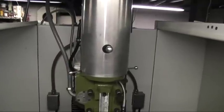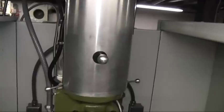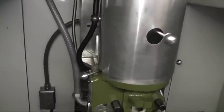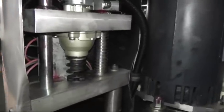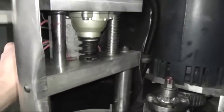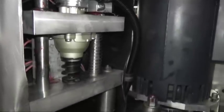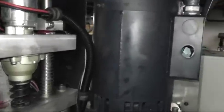And on the front here, that is the cover for the electric power drawbar I made up. You just flip this lever here, flip this one, and there's the drawbar. It's just a Ryobi cordless electric impact wrench. Saw another YouTube video of a guy that made one. I thought, oh, I like that. No air compressor to make noise.